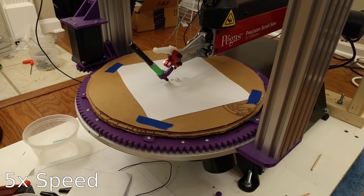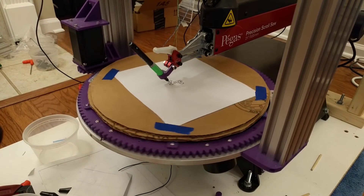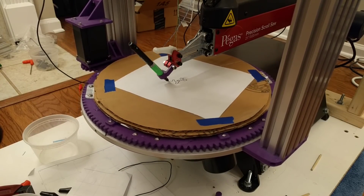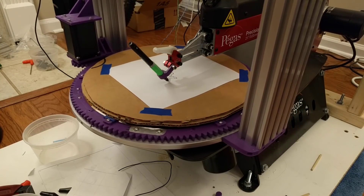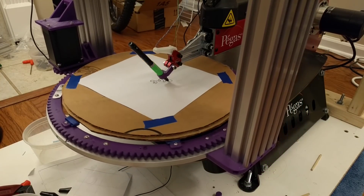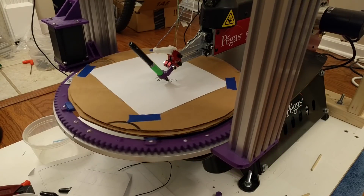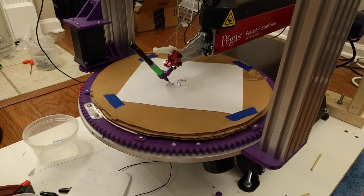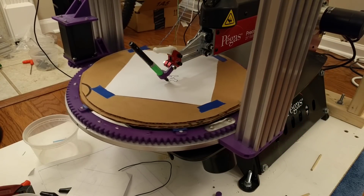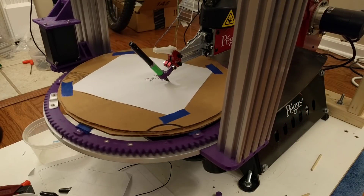The interesting thing about the movement system is that the saw blade can only cut when you're moving in the positive Y direction, i.e. towards the back of the saw. This means we have to constantly rotate the workpiece tangent to the curve we want to cut and then move forward a little bit. This control system is non-linear, and I'll show a quick demo of what that means a little bit later.